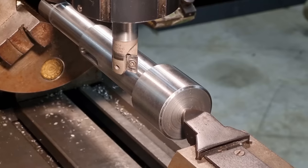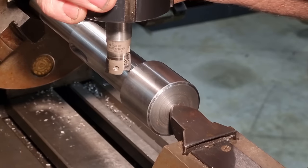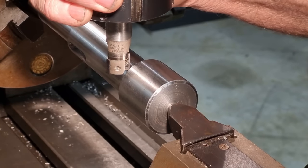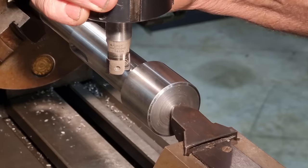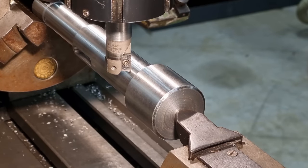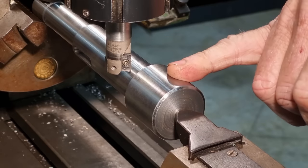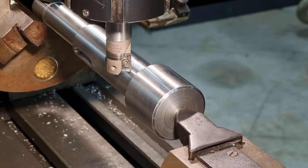So we're going to run our cutter at 900 RPM. Now, it's a fair bite for this to take out in one hit, but we'll just see how it goes. Bearing in mind too, this is EN25 grade steel, so it ain't no mild steel or anything like that.